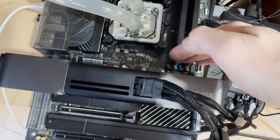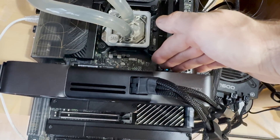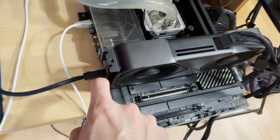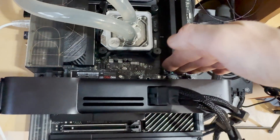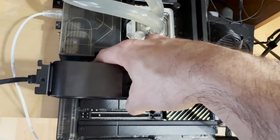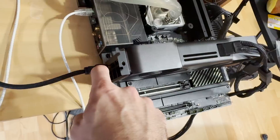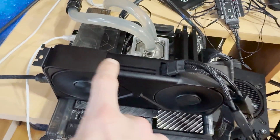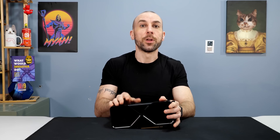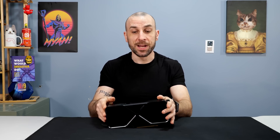Interestingly, the air coming out of the right side of the card is significantly warmer than the one coming through the blower. I don't know why — there might be something going on with the design. This side is doing most of the work. The back plate is hotter than the air coming out of the blower, so something's going on with this side of the 5070. Peak temperature is about 76 Celsius. Alright, so we've got our base numbers — now let's pull this thing apart and see what we've got going on under the hood.